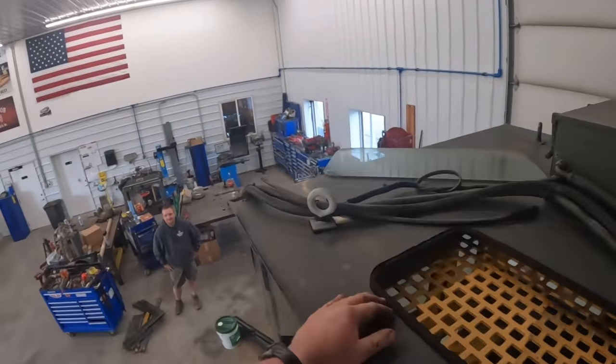So that being said, I think Kevin and I are gonna take a nut off one of each of these cylinders. I'm not sure, I may order some chrome rod stock up and actually make a replacement for that one. I may do all of them. Cylinders are getting pretty expensive right now to re-chrome, and if this stuff gets pitted too deep, then they can't re-chrome it. This one here bothers me a little bit. It's got some pretty nasty nicks in it. It's just from sitting out and not using it.